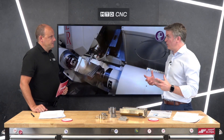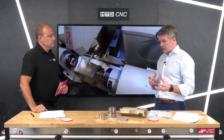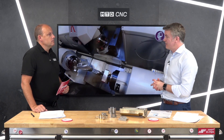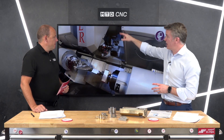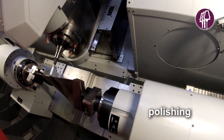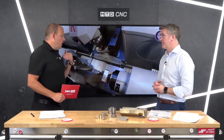In terms of getting one of these onto your machine, the process starts with sitting down, looking at drawings, and deciding on your particular materials with Hybrid and any manufacturing institute involved. Once you decide to go ahead, we take the order, have a kickoff meeting, and we need your machine for up to two months depending on complexity — but for more simple applications, two to three weeks is typical for installation. This particular one here is on a slant-bed lathe, which is slightly more in-depth to allow the laser, gases and feeds through.